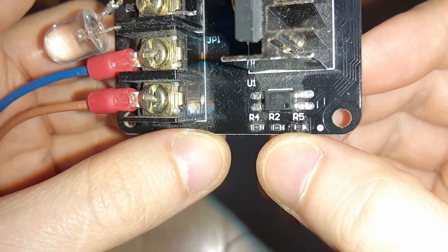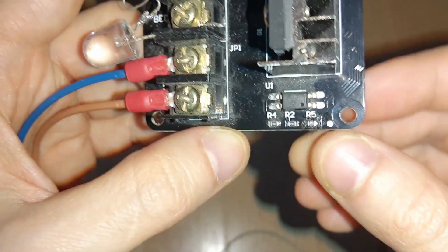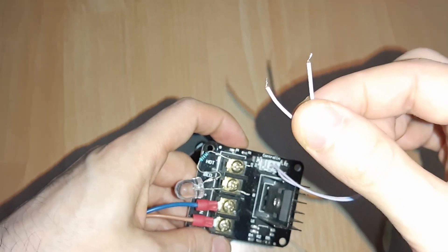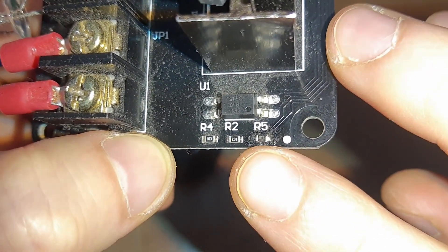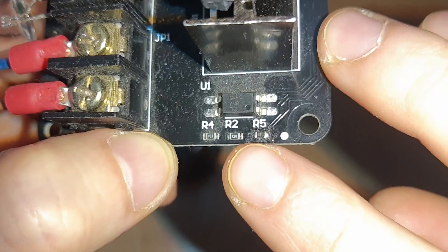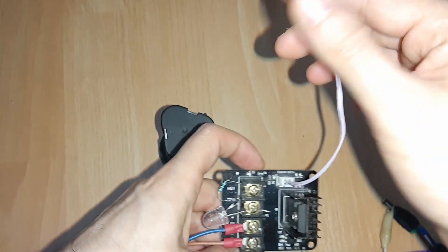What controls that is this resistor here — you can see it says 103, that's 10k. If you want to use this and trigger it with your microcontroller like an ESP32 that uses 3.3 volts, you need to desolder this one and put a 1k resistor here instead. With a 1k resistor you can connect this to your ESP32 and trigger this MOSFET and everything will work.